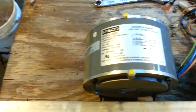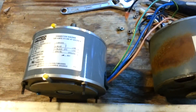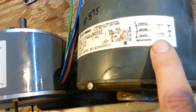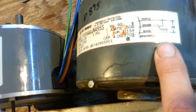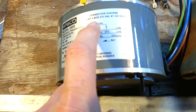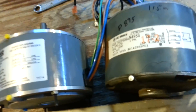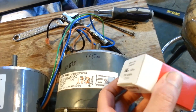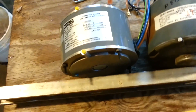That's going to work out fine for me. The wire colors are a little different, but that's not hard to figure out. On the old motor I got my lines — 120 volts on each leg because it's a 220 motor — so I got my purple and my black. On this new one I've got blue and black. My black wires go in the same spot, and my blue on the new motor will go where my purple wire went. The brown goes to the capacitor. When you change out a motor, always put on a new capacitor — it's just a wise thing to do.